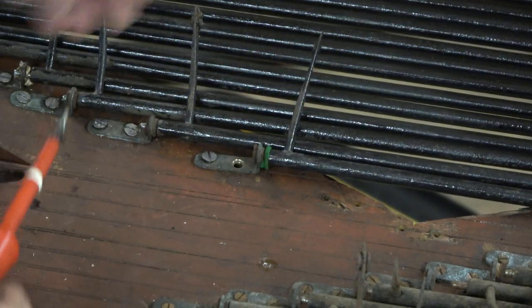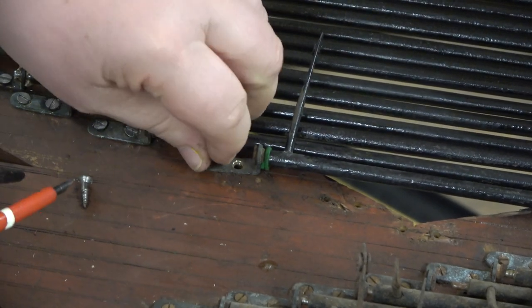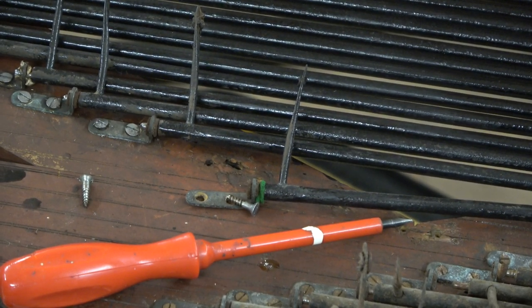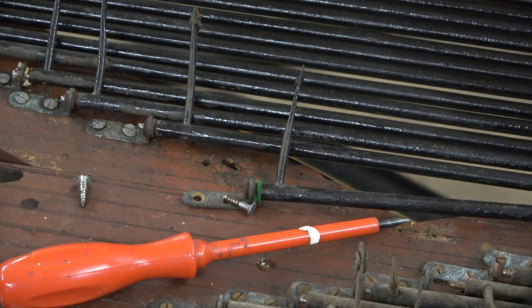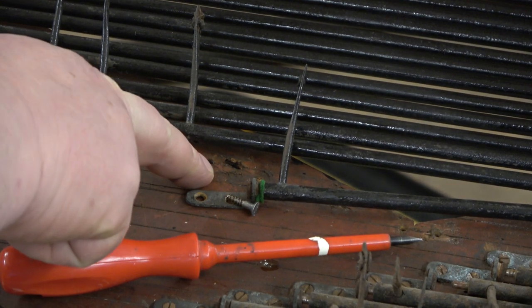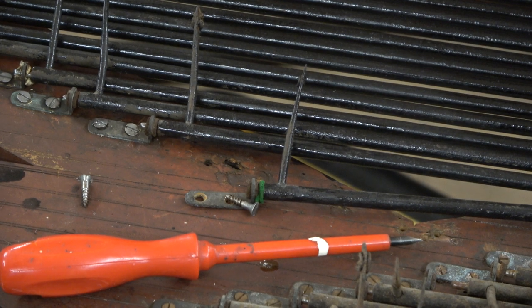That's just going round and round and round, so we're going to have to put in a piece of timber to block that hole. You can see it's pretty ropey. I haven't had to do this on any others, so it's typical that it's the demonstration one. I could glue in a matchstick — that's probably the easiest thing to do. So I think that's what we will do: glue in a matchstick and come back to that tomorrow. I'll use modern white woodworking glue. We could also cut a piece of dowel down to a point and hammer that in, but as it is, it's no good.